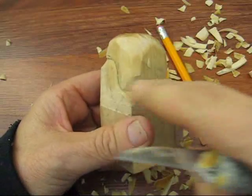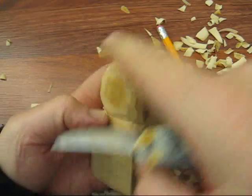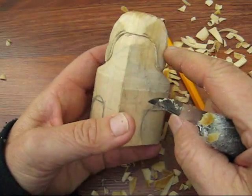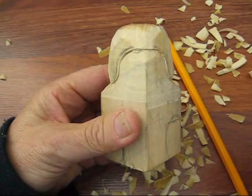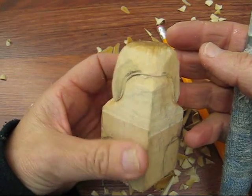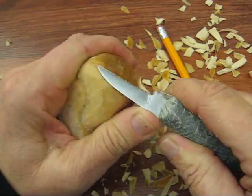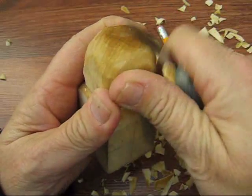A lot of times you try to get your profile done first. Then you look at it and go to your front view and say, okay, is it rounded enough this way? So there are a couple of ways of looking at it — you're going to look at it from the side and from the front. When you get the profile right, the rest kind of falls into place. I always found that getting the profile correctly helps a great deal in finishing your carving. So don't hesitate to stop, look at it, and assess it all the time.